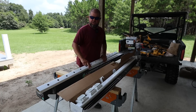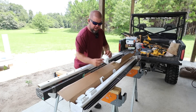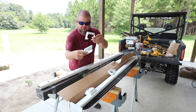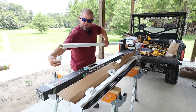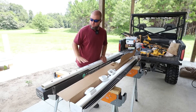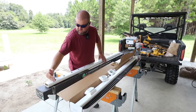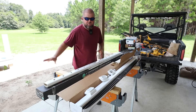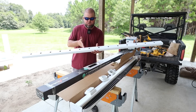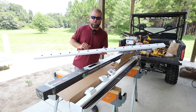If you wind up using one of these kits, you need to be careful — there is a top and a bottom. They look exactly the same, but it's all in how these pieces fit on. We don't want to see any grooves where these pieces snap together — you want that to be down beneath the top cap. Pay attention to that before you go installing these. I'm going to grab some quick measurements between our first set of posts and cut these down, taking equal amounts off each end so my balusters stay perfectly centered between the posts. It'll just look better as you look across the railings.